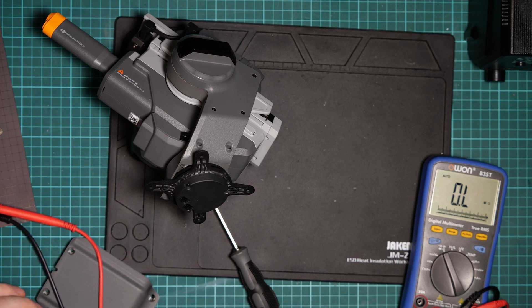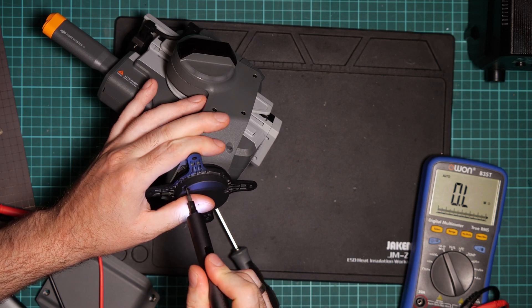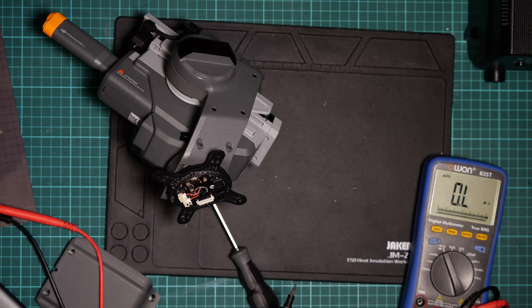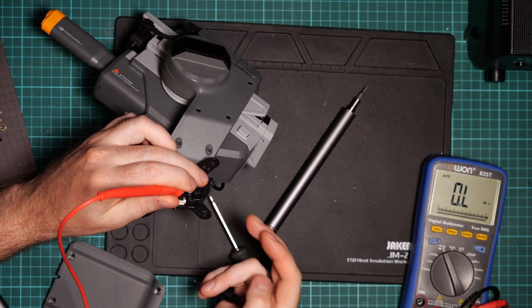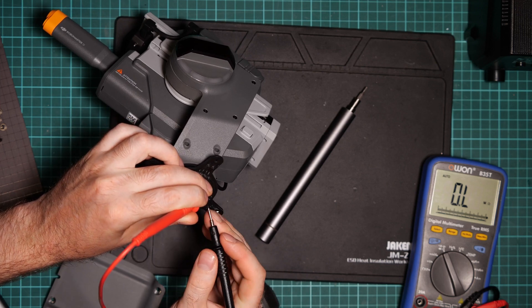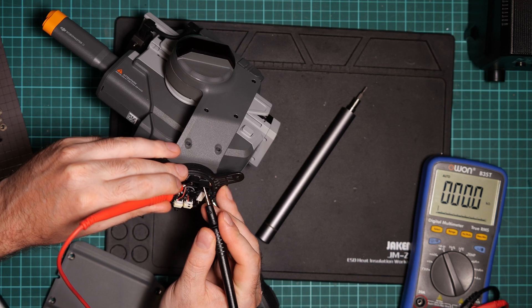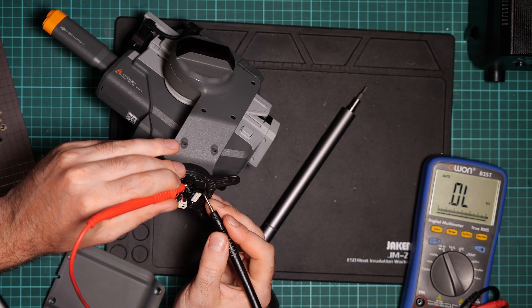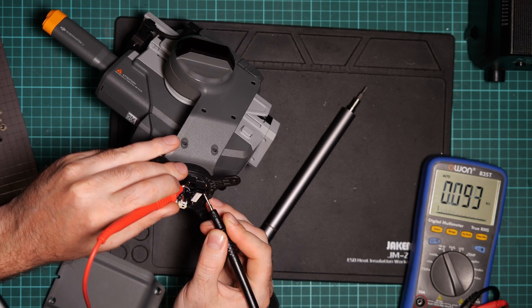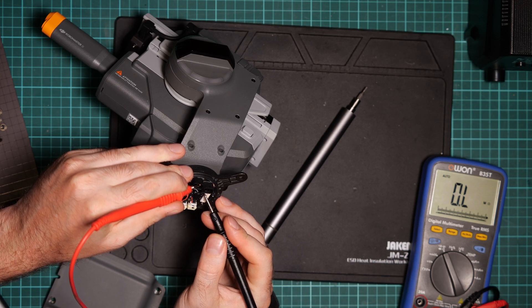Got it — I think it's somewhere here, there's not the expected 120 ohms. Looking at the connector, I can see the CAN lines: measuring between the low pin and this one gives zero, so they are interconnected. The first pin of this small connector is the left CAN and this is the right CAN, and they are connected.